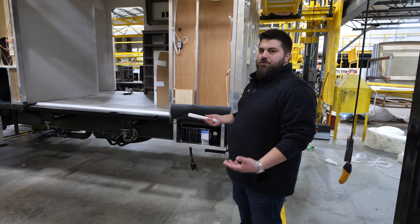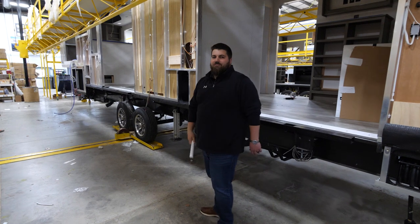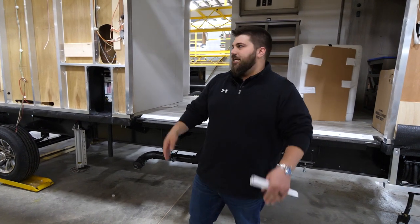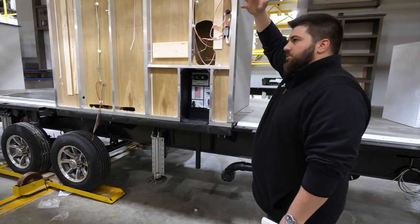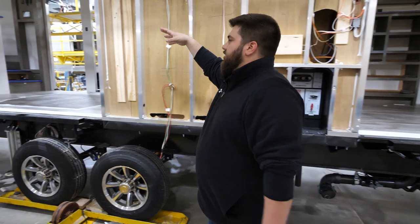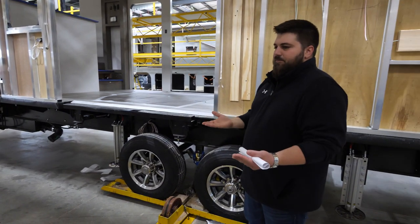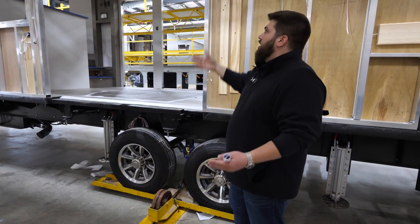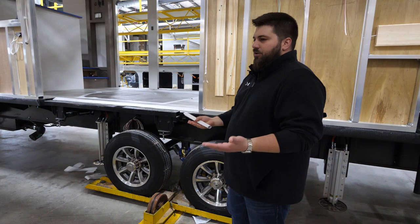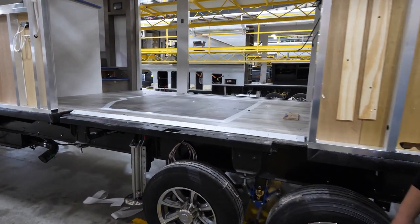Here we are in the scaffolding where the roof decking is going to be installed. You're going to have half-inch plywood decking on the roof, going over 5-inch radius rafters so rain and water will roll off the sides. The roof is built in 8-foot sections — instead of trying to put a 40-foot roof on at once, we carry 8 feet at a time. They're built a day ahead of time and left sitting upside down because you've glued and pin-nailed your interior decor boards on the roof to let that glue cure overnight with the rafters upside down.